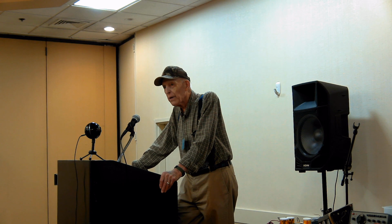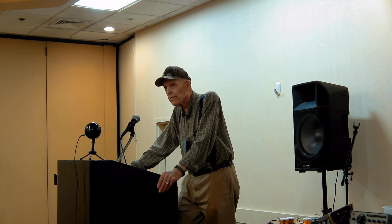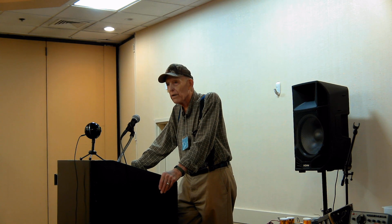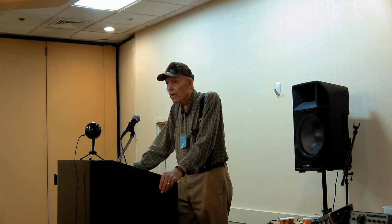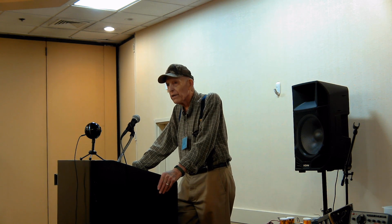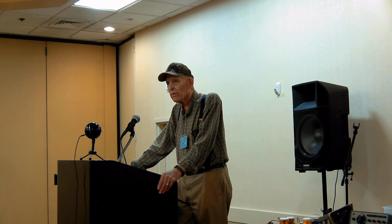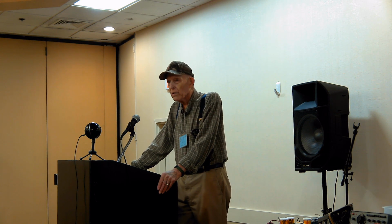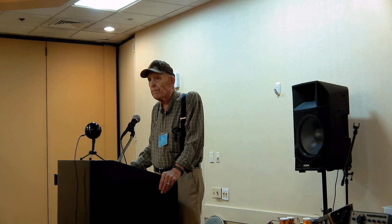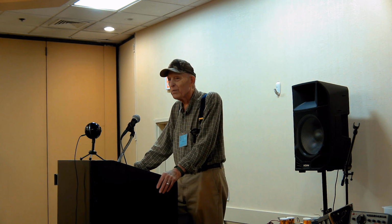It all depends on what kind of repairs you do. If you're working with FM sets, you'll need up to 10.7 megahertz for sure. So I would get a 50 or 60 megahertz set. You don't have to look at the RF signal very often with a scope, but you do have to look at the IF, so you have to be able to cover the IF of any of the things you're working on. Now, if you're working on ham transmitters or something like that, you're going to want one that goes up to at least 50 or 100 megahertz, because you're going to want to look at the waveform that you're putting out on the antenna, because that's what the FCC does. And you don't want them to be one step ahead of you.